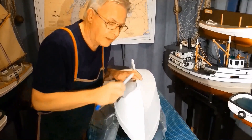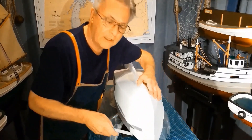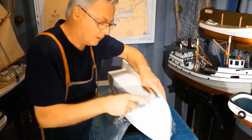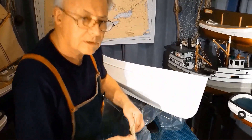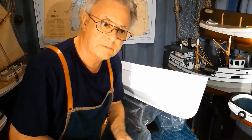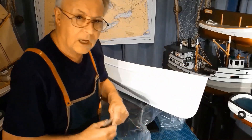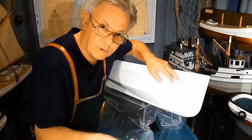The first step with a hull that's come out of a two-part mold is to just do a once-over on the seams where it's going together. You have to sand this gel coat to give it a little bit of tooth so it'll accept our latex primer. I use 80 grit to do that. Unwaxed gel coat is fairly easy to sand — it doesn't clog up the paper at all.